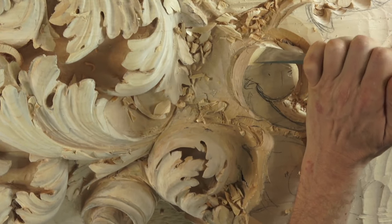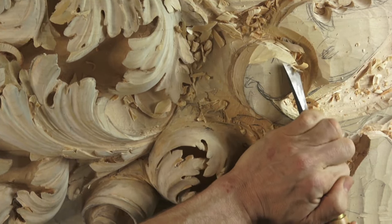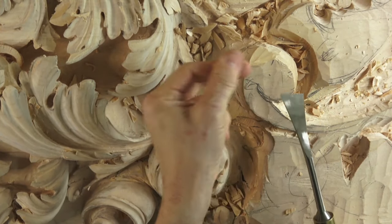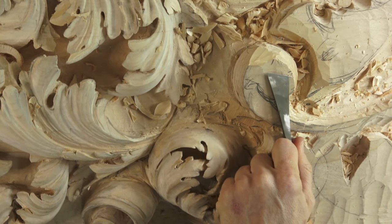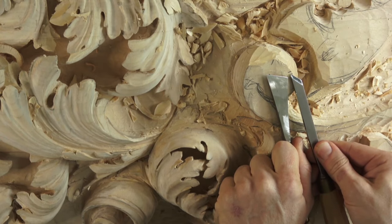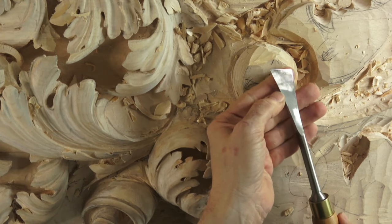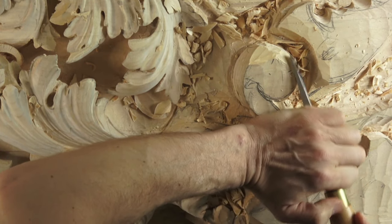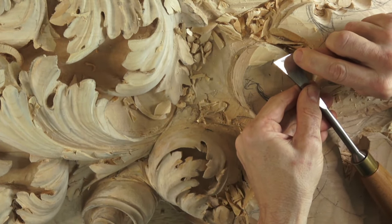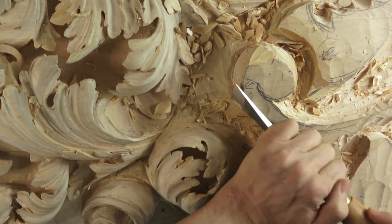There are different skews - not just one kind. This skew is 20 degrees. I also have 45-degree skews, but I really like using 20-degree skews because I use the back side of it a lot. I use it from the half of it, just the bottom part, so I can shape really quickly whatever I need.